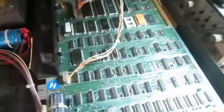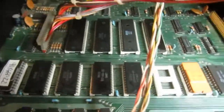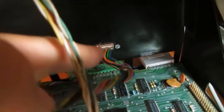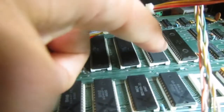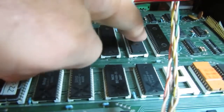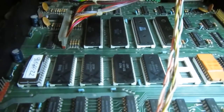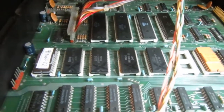That's loading correctly. So that was it — a bad 6522, which makes sense because this interface here, I don't know what it was for, but it's connecting directly on the pins of the user port that go to port A of this 6522. So at one time something happened and some bits of this chip were damaged. This pretty much solved the problems with this PET, which is now working properly. Thank you for watching.